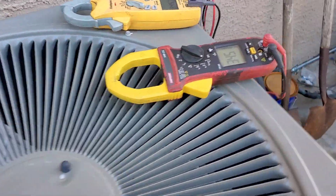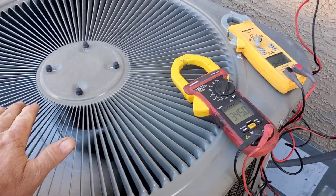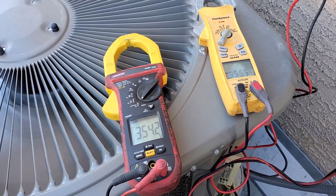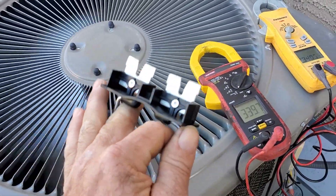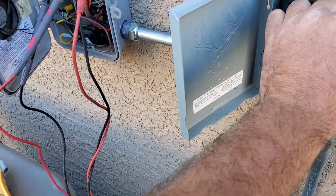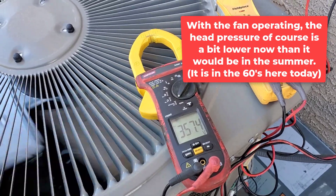That's how the head pressure goes nuts — 345, so it's going to start dipping. But 330 volts would be the rated voltage at full output. I'm going to turn the fan on. I'm going to unplug the DC here — watch my voltage. At 360 unplug — yeah, so at this point my DC from my solar panels is lifting up the voltage in the DC bus up to 360 when the power from the utility and the solar is plugged in at the same time. Plug it in — 360. And I'm going to unplug the AC — it's about 360 while at that head pressure until the head pressure starts cranking up.